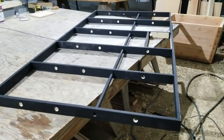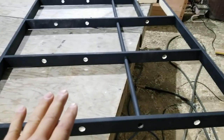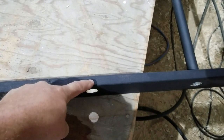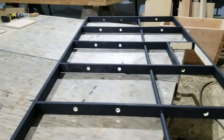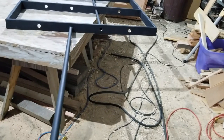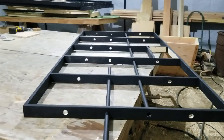The next step is to take these spray-painted bars, slide them into place, and then on the back side of each one of these walls I'm going to take one tek screw and screw right through the center of this one by three into the metal. That way the outside face will be the cleanest, and then we'll go back and touch up anything that needs to be touched up. Insert, slide into that one, slide into the next one.